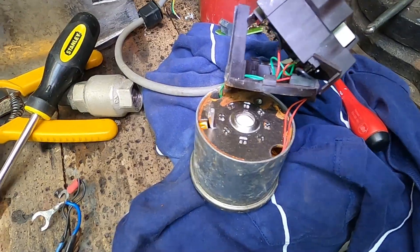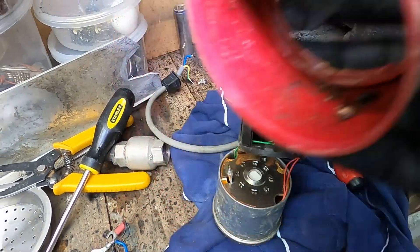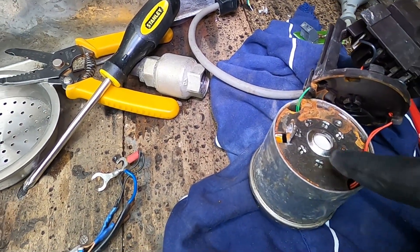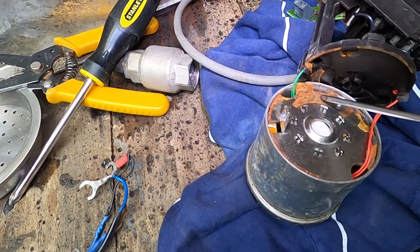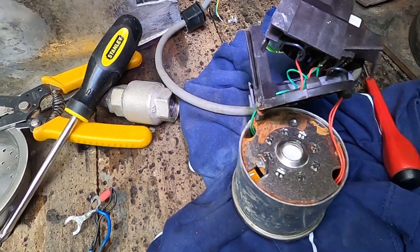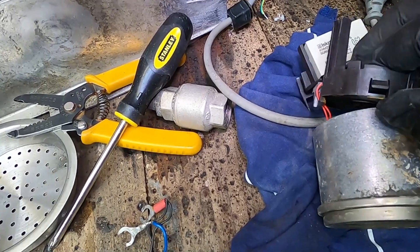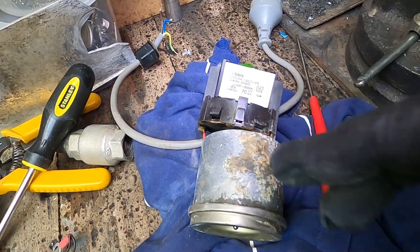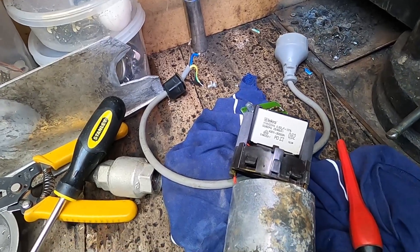I managed to get the red ring off - that was just two little clips on the side - and then easing the top clips out to get to the center plastic molding, which was just clipped on. Just pointing out some evidence of water inside here - the seal has failed and it has got wet inside, but it's not too bad. This is a completely sealed unit so we can't get further inside. The only idea I've got is that this capacitor has failed and may not be allowing the winding to have an out-of-phase between the two, which would make sense. I'll see if I've got a capacitor to give it a test; otherwise I think it's in the bin.